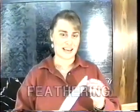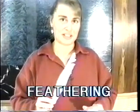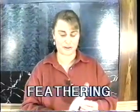The next technique we're going to do is the feathering, and we're using white goose feathers. We have these for sale. They're very inexpensive. Anybody can afford it. Or you can go out on the farm and pick one up somewhere. It doesn't really matter. What we do is we wet the feather in the glaze, just so that when you start off, you don't take all the glaze off that you have on the board. I'm not even going to wipe the board off. I'm just going to go ahead and feather it.